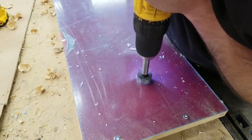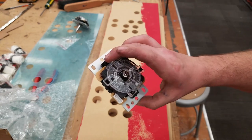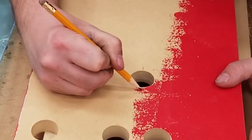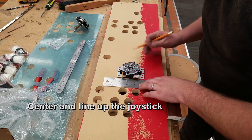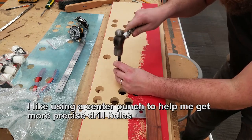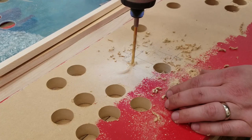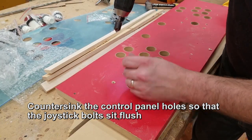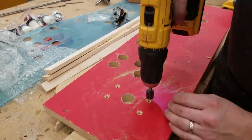A drill press would be way faster. However, I said I was going to do my best to do this project with mostly hand tools or power hand tools. I keep telling myself that I'm known far and wide for eyeballing measurements — that's kind of just what I do here. I get it as straight as I can. There's going to be a little cover that covers the main hole of the joystick, but I'm still going to measure it mostly and get it lined up. This is going to be held on with four bolts and nylock nuts. Now these bolts are eventually going to go underneath that plastic sheet, so you won't be able to loosen or tighten them — but they shouldn't be going anywhere. Because the plastic sheet is going on top, I need to add a countersink so the head of the bolt is flush with the top of the control panel.